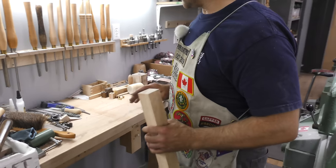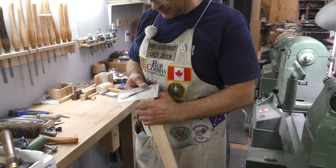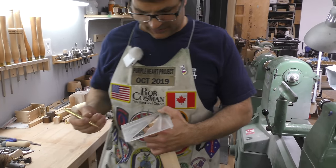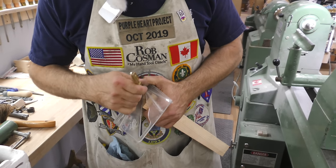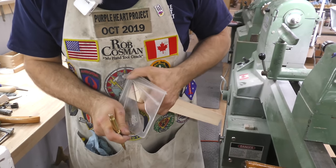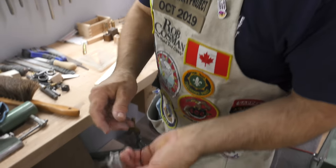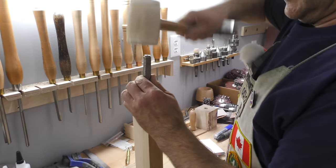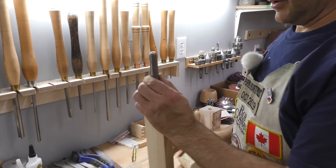If you're going to practice, practice on a really soft, easy-to-turn wood — this is a piece of northern white pine. Basswood or even poplar works well. I'm going to find my centers. On one side of the center finder you can find the center of a round piece, and on this side you find the center of anything square. Reference that off the two sides, draw your diagonals on both ends. I'm going to take my spur center and put that point right on the cross section — just drive it in enough to make some contact so the spur center can grab the wood.